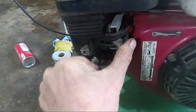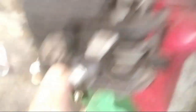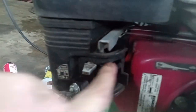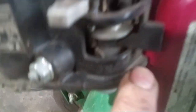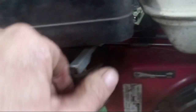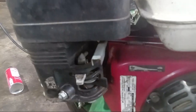Make sure your switch is in the on position. Your choke would be all the way over to the left — you can see a sticker for the choke and the gas, but sometimes these are all worn off. To choke it, go all the way to the left. For gas, you'll see a little 'on' with an arrow — make sure gas is that way. You can throttle up; typically you can put it right in the middle or I usually put it three-quarters of the way up.